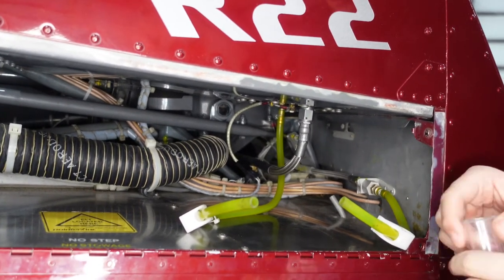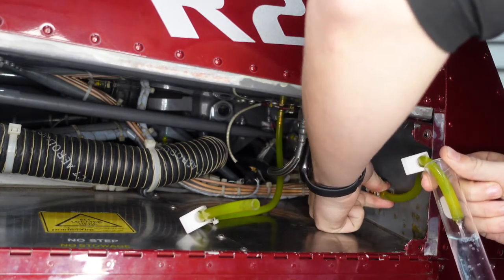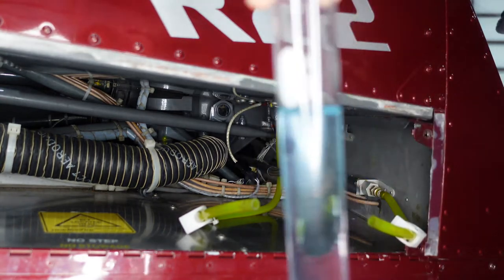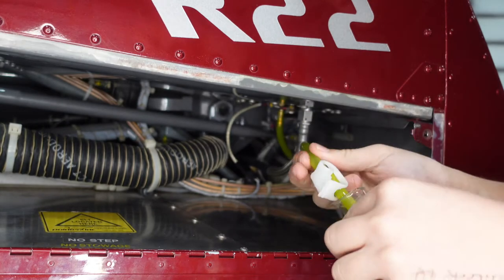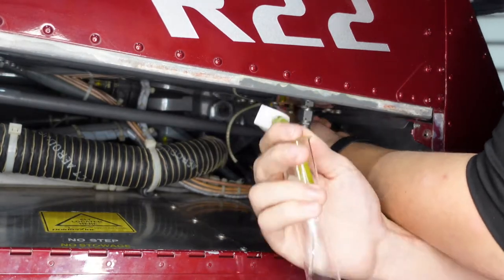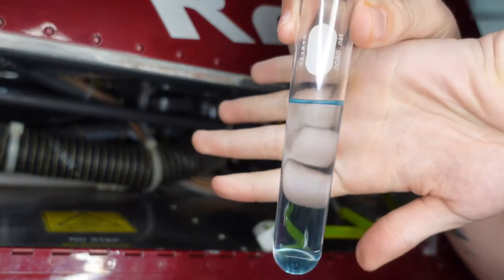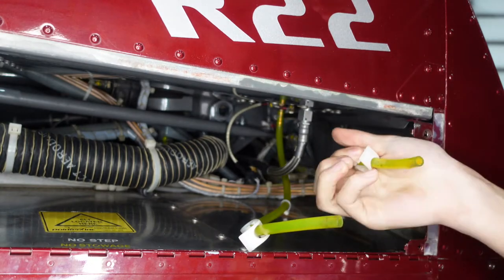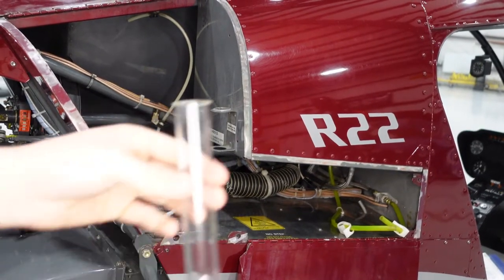The first thing we're checking is the fuel. We take these yellow tubes, open up the white thing, and push in on that brass nipple so the fuel comes out. I'll hold it up to the light to check for water, dirt, or contaminants — this one looks pretty good. That's going to the main fuel tank. Same thing for this one: put the yellow tube inside the glass beaker, open the white thing, push up on the brass nipple and fuel comes out. No water, no separation, no dirt — looks good. I can just throw it back in the fuel tank; it doesn't matter which side because they're interconnected. Make sure there's no fuel left in the lines because that's a fire hazard.